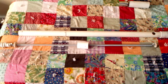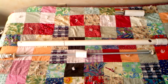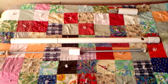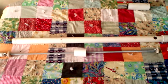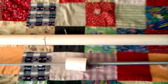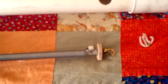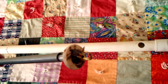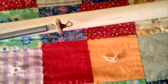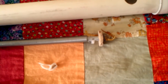This is our parachute piston ejection system. The key components are the 1.25-inch PVC pipe and two couplers. One goes on the end that's attached — crammed down as far as it will go, so it's semi-permanent but can be taken off if needed. The other I've left free-floating, and it's actually part of the spring-loaded ejection system itself. We have an extension spring, and on the end of it I used a hole saw to cut a round piece of wood just as a guide — as the piston travels down the PVC pipe, we don't want it to flounder around, as that would make the ejection inefficient and reduce the power releasing the parachute.